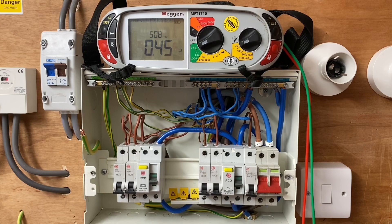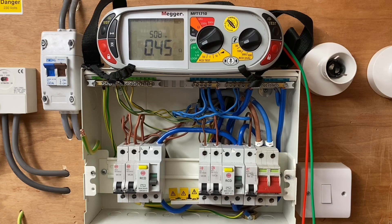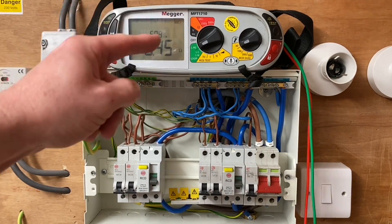No need to panic. In the event of a high reading, we've got to remember that it is not at our discretion to change anything with the intake - we would contact the local DNO and seek their advice. When you come up with this scenario during testing, seek advice, they will give you a reference number, and on the comments section of the electrical installation certificate or any relevant certification, write that reference number down with a quick explanation of the scenario - it's almost a get out of jail card. However, we told the learners it was TNS, and the maximum for TNS is 0.8 ohms, so in that case 0.45 ohms would be an acceptable value.